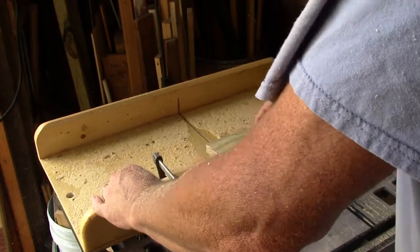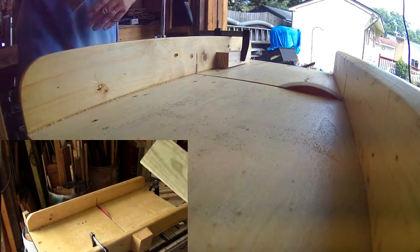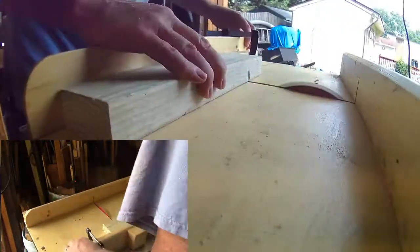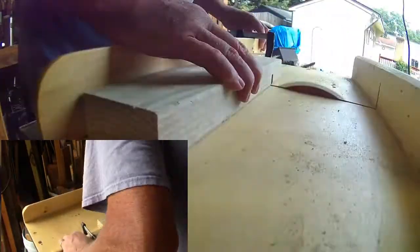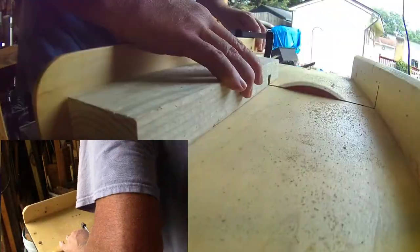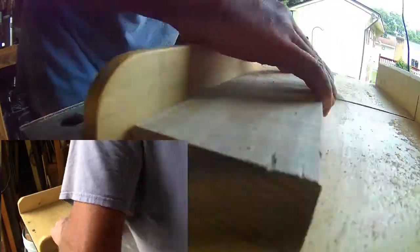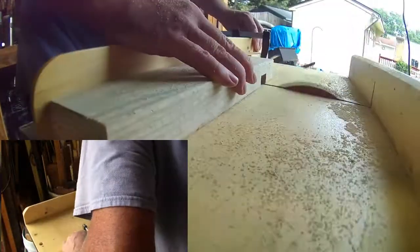No dimensions on this. I think I took about half the thickness of that 2x4 out, so it's about 3/4 inches deep. But I thought it looked nicer sitting against the edge of the chair rather than sticking out all the way. Plus it gives the chair a place to sit on top of that rabbet, so it's better support.